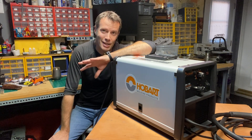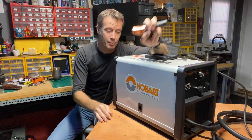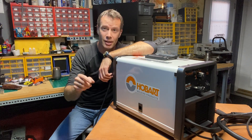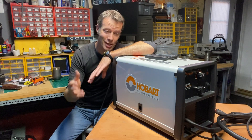Something that comes up as soon as you start welding is trying to figure out where to weld safely, and one of the best ways to do that is to have a dedicated welding table. That's a metal top stand or table that you can connect your ground to, then put anything you're welding on that metal surface, complete the circuit, and do the job. It's fantastic for any number of reasons: it ensures a solid connection, making it far safer to weld, and it also keeps everything else from getting beat up and burned from the spatter that inevitably happens when you're welding.